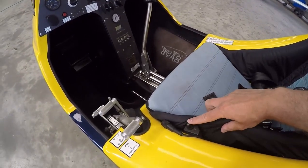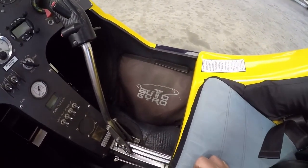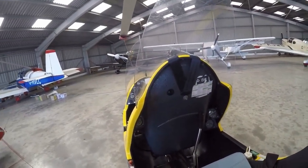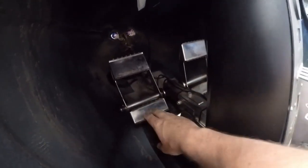Looking inside, this one's got an optional heated clothing adapter, a radio plug-in, a regular harness, and down inside the usual document case familiar to every autogyro owner — you can also store the rotor tie in there. The rear compartment is reasonably spartan. It has the optional instructor pack, which includes stick, throttle, and brake. In the footwell, you'll notice that the rudders articulate slightly differently from what you may be used to in Magni products or a regular airplane — they hinge from the bottom, a bit like an organ pedal. This means people new to these aircraft can be pressing hard and not moving the rudder at all, which is amusing initially.